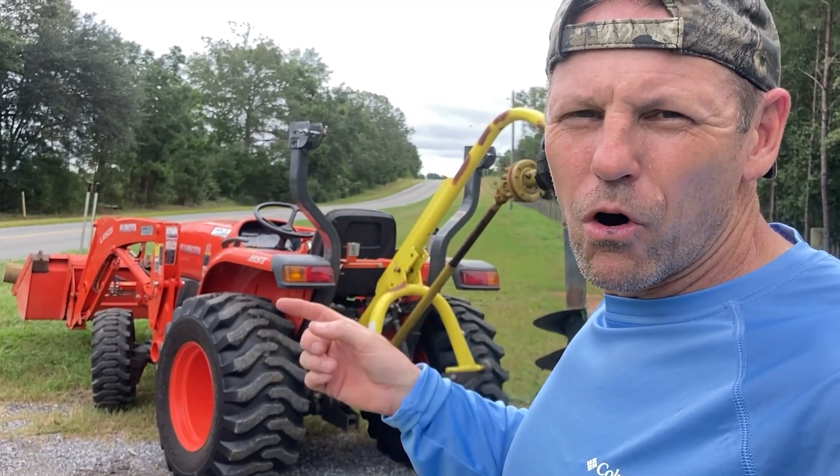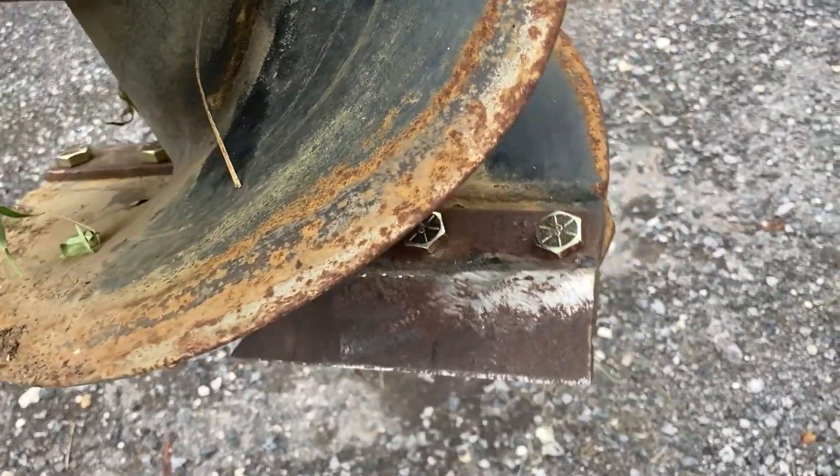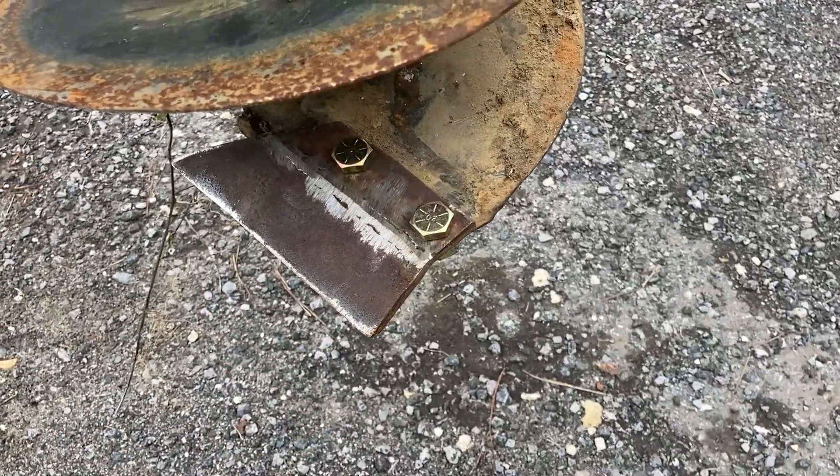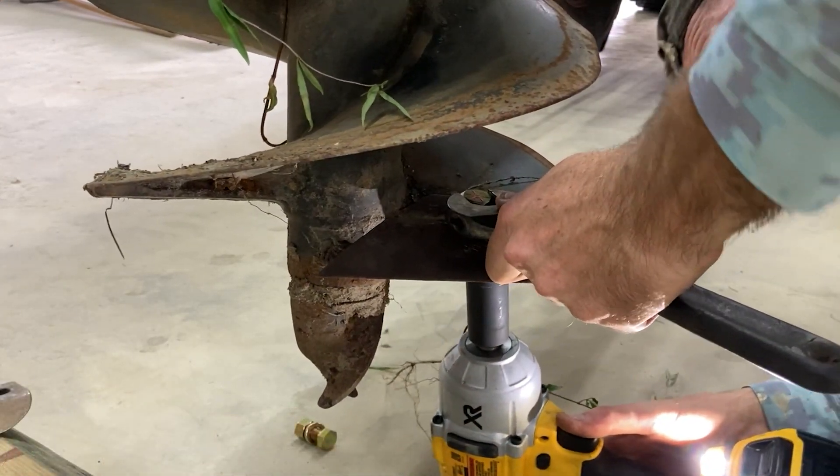The first thing I had to do is put the auger on. For those of you with tractors with three-point hitches, the auger is one of the hardest things to put on — it doesn't have a top link, it has that long yellow arm. I also had to rebuild the auger because the points were worn out. We put in over 100 fence posts on the property, and the hard red clay here in Florida wore out the auger bit, shearing off the bolts. I couldn't find new bits so I had some fabricated — my welder took hardened steel and created new auger bits.